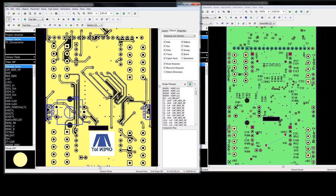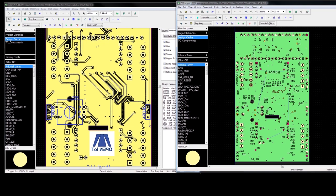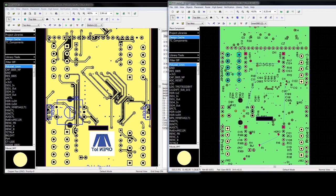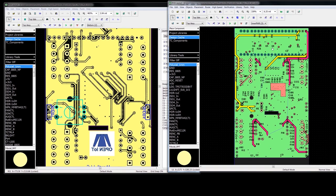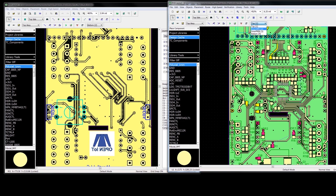With the four-layer board we don't have that problem anymore. Even though it looks cut up, there's lots of greenery for the return signal. The power layer is also flood filled with ground, but I ran all the power traces with nice large 40 mil traces. Here's 3.3 volts coming down to the headers. Down here is a rotary encoder — it's kind of hard to see with the flood fills turned on.